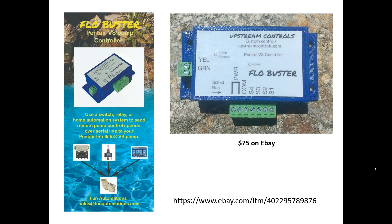The controller itself is kind of the heart of the system. I found a company on eBay that sells a controller that communicates to the IntelliFlow. The cool part is that they do all the hard work — all you have to do is basically close contacts on the S1 through S4 interfaces to the common pin, and it will automatically send commands to the pump. This controller is $75 — check it out.